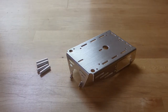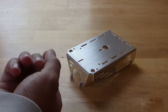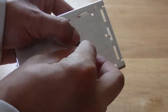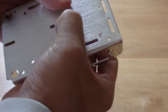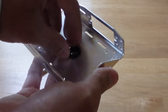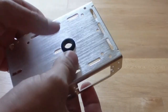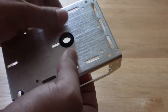For our intent we're going to actually be mounting the circuit board to the standoffs. We're also going to need a rubber grommet, which is going to go in this through hole. You just scrunch up the grommet and apply it in there — it takes a little bit of bending to get it to fit just right, since it's made to fit tightly. Go along the edge and make sure it's all even all the way around. This grommet is protecting the through hole where some wires are going to go through, since the cut edge of the metal can be a little bit abrasive and might actually cut into the insulation over time.